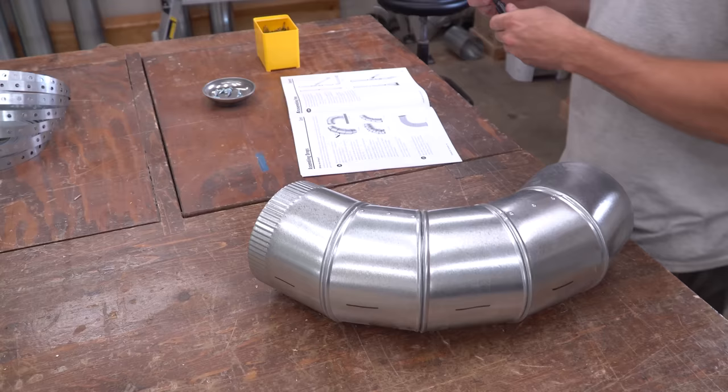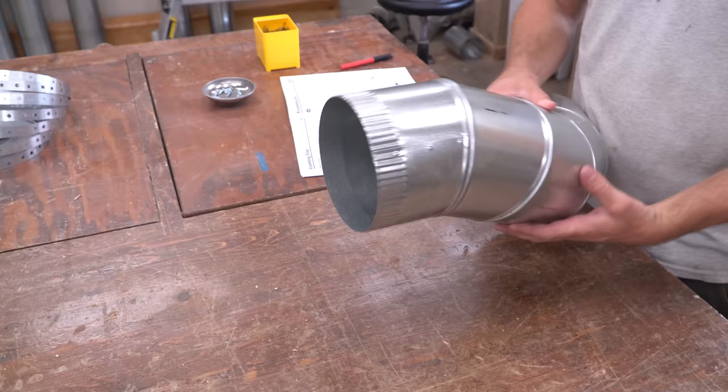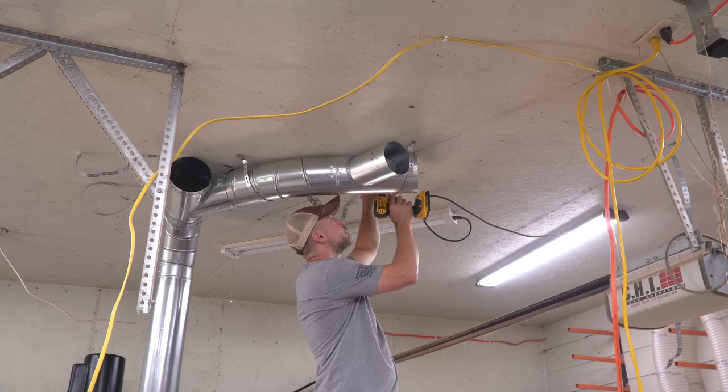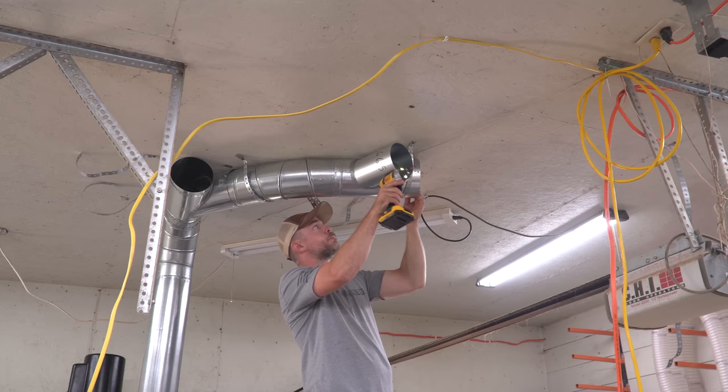Right away I needed to branch off to the far wall but also avoid some junk on the ceiling, so I needed a very slight bend in the line. To do this I used a 90-degree fitting and straightened it out so it only curved a little bit. Smoothly adjusting a 90-degree elbow into some other angle is simple — just make a mark on the outside of each segment, then rotate every mark in the opposite direction, keeping left turns lined up and right turns lined up. With a bent pipe in place followed by a Y, I used straps screwed into my sheeted ceiling to keep everything from crashing down. Leaving them with some slop now makes it easy to come back and tape the seams.